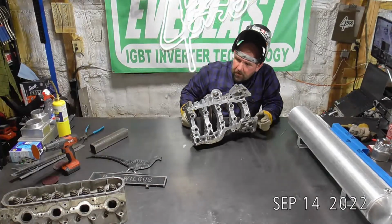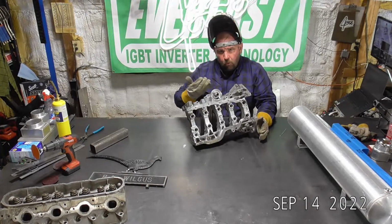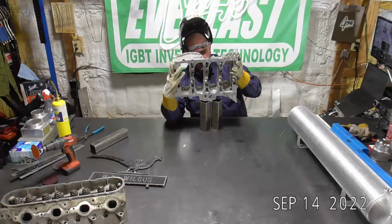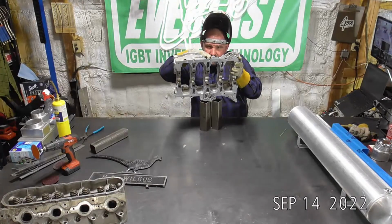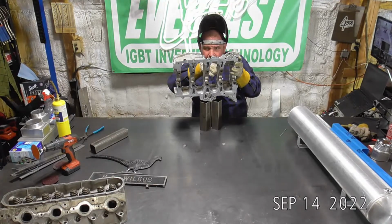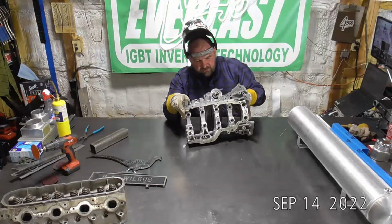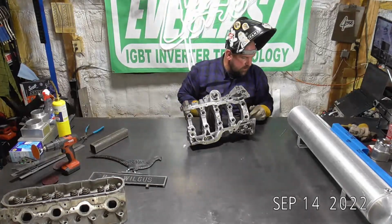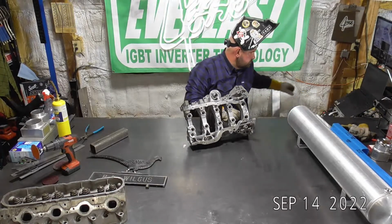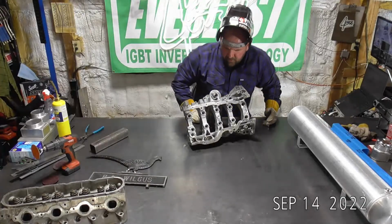I'll probably go up on amperage. I'll probably go up to 300 amps. I'm gonna heat up that whole weld pool, and I'm gonna have it sitting like this. I'm gonna let gravity take over and have that weld pool just sink down in there a little bit better. And that helps with not having as much cleanup for me, so I won't have to run the die grinder for 3 hours trying to clean that up. The spool gun would definitely fill it faster.